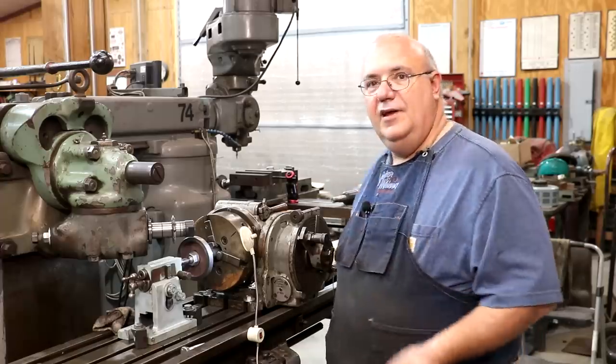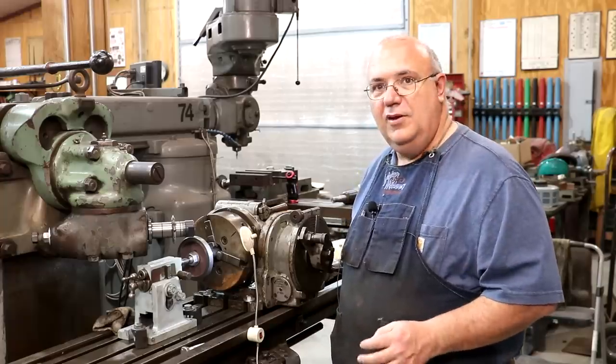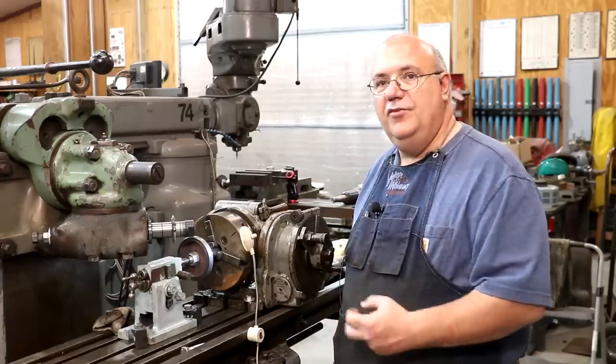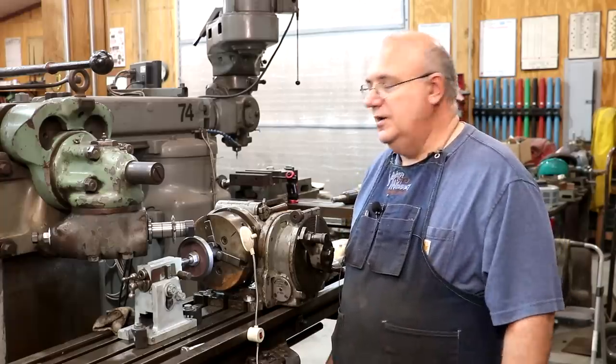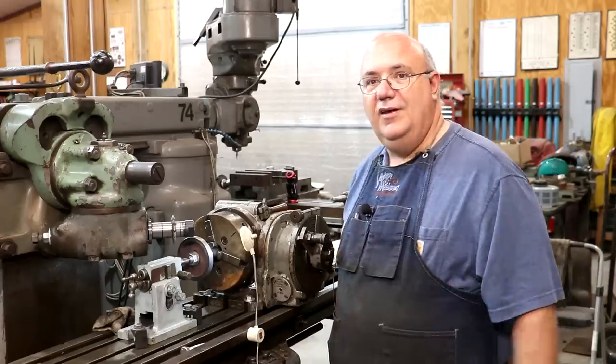So I don't have a keyway in here — it's just basically friction. This is on a tapered shaft and we've got a screw tightening it up in there. It should be plenty tight enough, but because of the forces involved in this angle, it's wanting to rotate this gear. By making smaller cuts, I minimize the chance of that gear spinning on the shaft and messing up the whole project. Enough talking — if you're interested in the setup and details, this is a whole series of videos. Let's get in here and start making some chips.